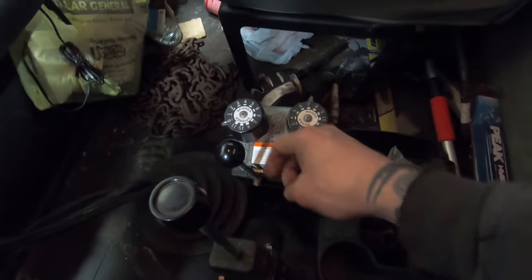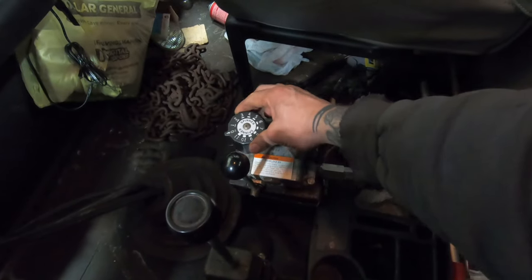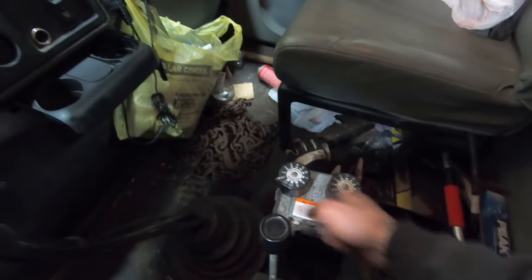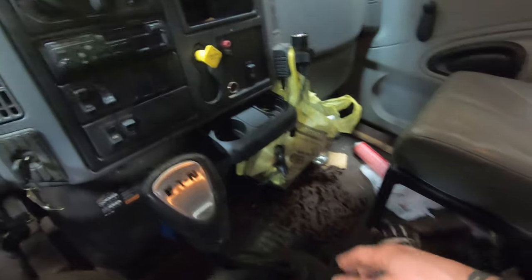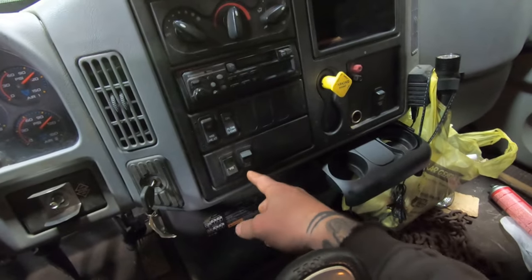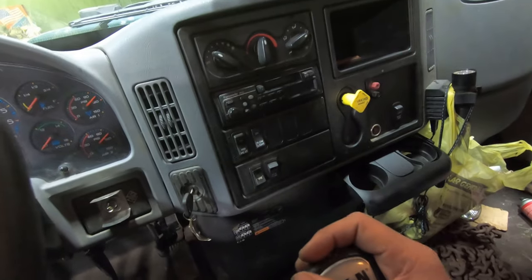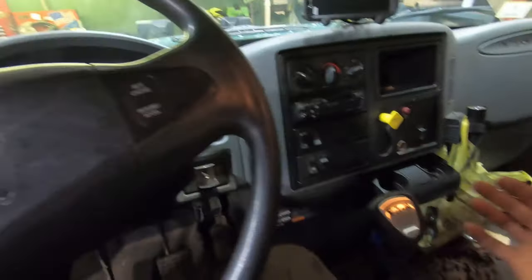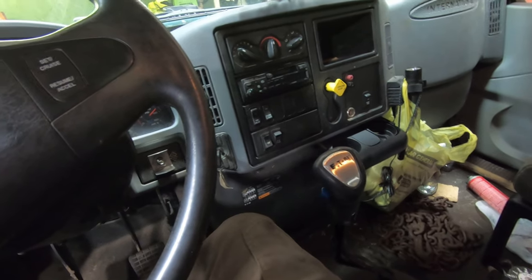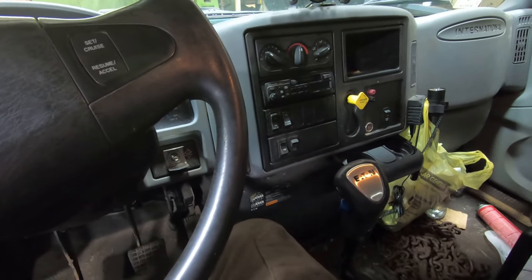This one has a manual sander control. You just turn it on and off, set your spinners, control speed with that, and control auger speed with this one. You basically just set it where you want it, turn it on, turn it off, and plow up and down. You've also got your roof beacon switch, HVAC controls, PTO, mirror heat, and plow lights. This one is also a manual transmission — the Eaton 8LL. All the manuals are the same transmission. I like the Eatons; they work pretty well.